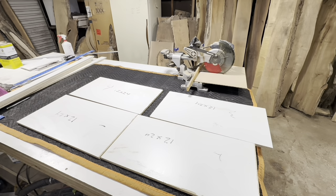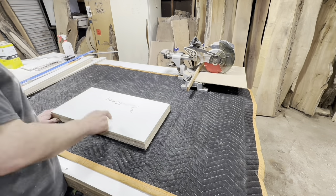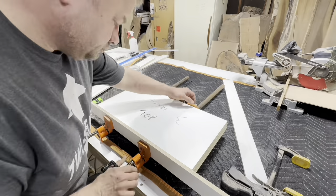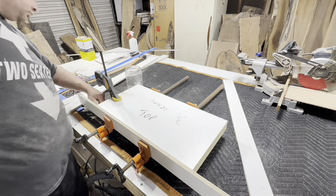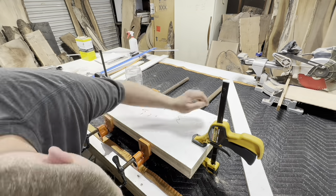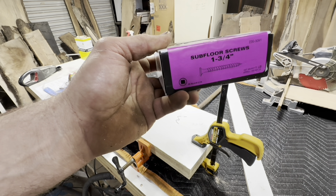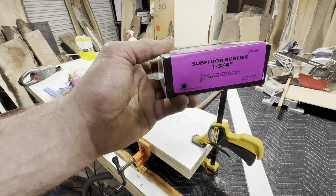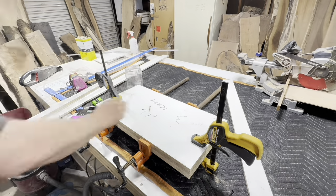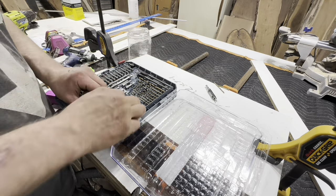They're a little bit bigger right now because the sheet of melamine isn't exactly 48 inches, it's 49. I'm getting a box kind of made up — just a 2-inch by 24 by 12 box. Clamping them down and getting everything as close as I can, then I use some screws to hold it all together. I pre-drill first. The screws I use are inch-and-three-quarter subfloor screws from Menards.